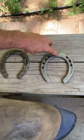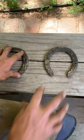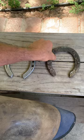Looking at this one, it's just the opposite — longer from the center point around the outside, shorter from the center point to the inside, fewer nail holes on the inside, more nail holes on the outside. So flipping it over, that's how they're going to stand: left front, right front. If they're not made that way, a lot of us forge them that way on purpose.